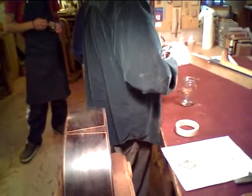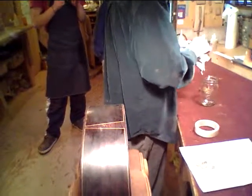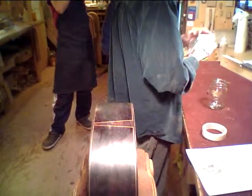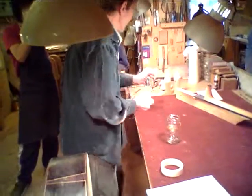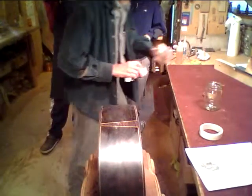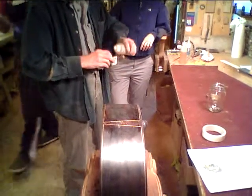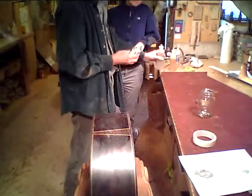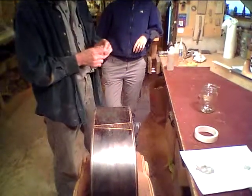Initially, I think I want to be on this part of the pad. I don't like that stripe. It seems kind of smooth material. That'll be fine. So I'm going to go quite wet initially with shellac and alcohol, about half and half shellac and alcohol.